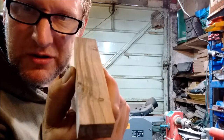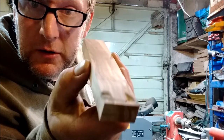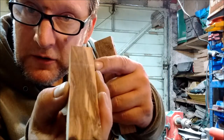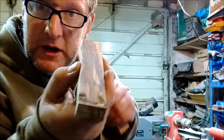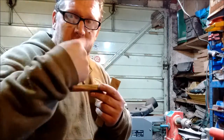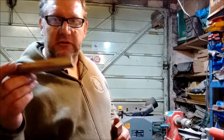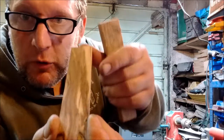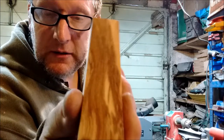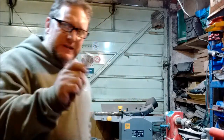that finish. Okay, that's sanded with 36 belt to that finish. Okay, this is a characteristic mark of a planer thicknesser. When it goes through, it grabs. Sometimes there's a bit of a rub mark as the driver rotor's moving in, and you get these distinguishing marks of, oh, that's a planer thicknesser that has been done on that. Anyway, I'm not worried at all about that mark, but you can see that the finish on that is better than that. But it's not the finish I'm after.